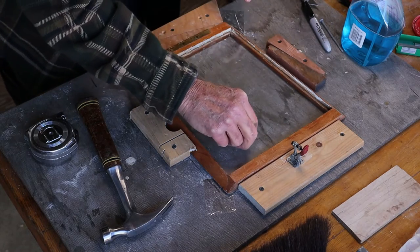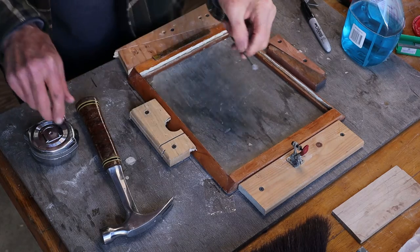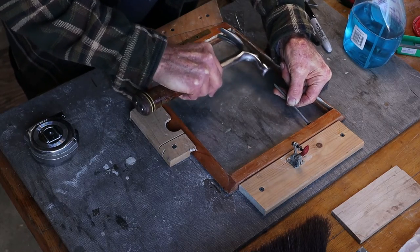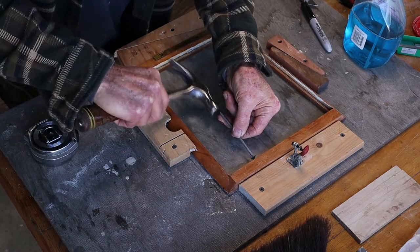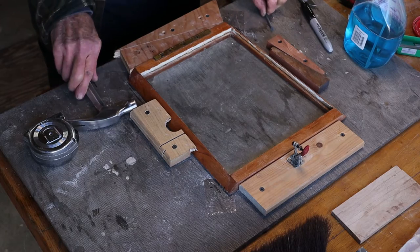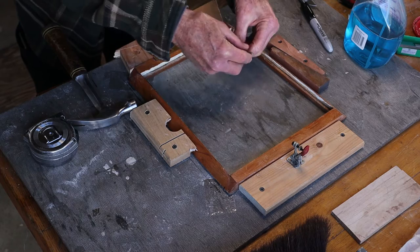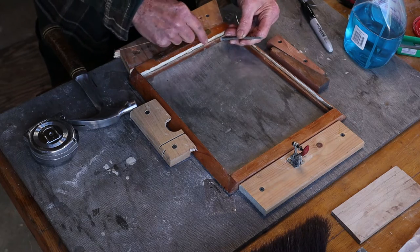Using glazing points to secure the glass in the frame. I took the head of a nail and ground off one side — these are tiny little points. There's always fear of chipping the glass and having a runner. The folding wedges — excuse me, folding wedges, they are blocks aren't they — help provide backing so when I'm tapping the points in, I've got something to tap against.